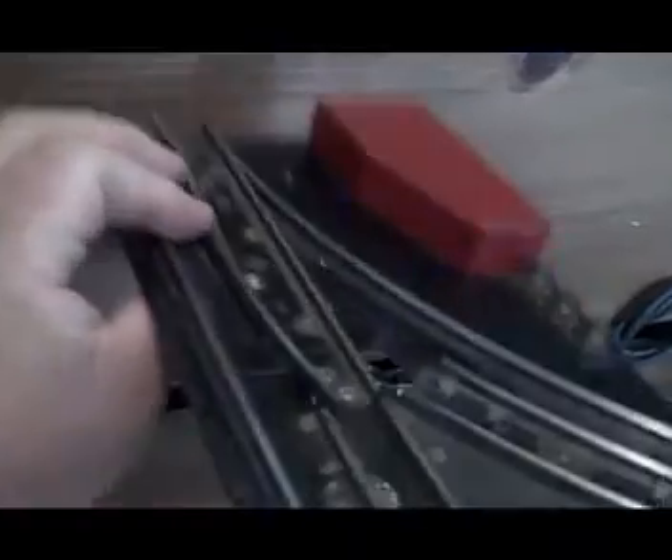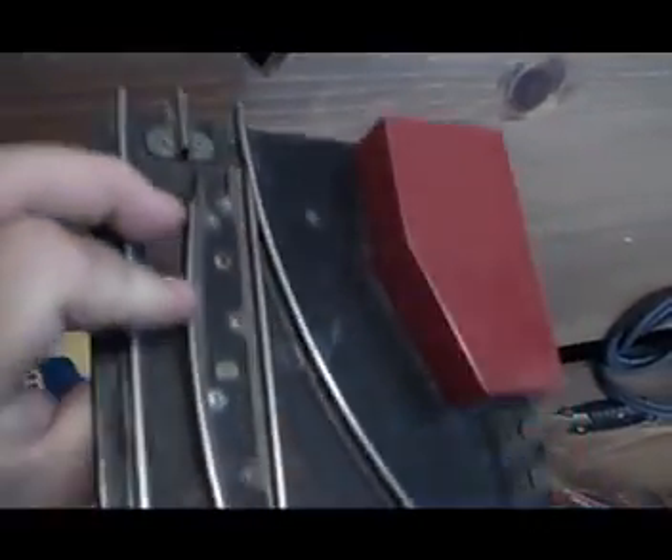That's the bottom plate and you don't see much there — there's a couple pieces of insulating electrical tape, and that is just to make sure you don't get the wire shorted out on the frame, the hot side, because that will definitely short out your transformer or power supply. Underneath the top plate, here's what we're looking at.